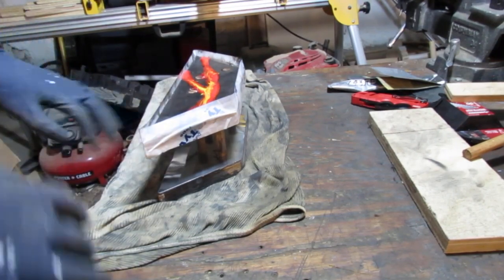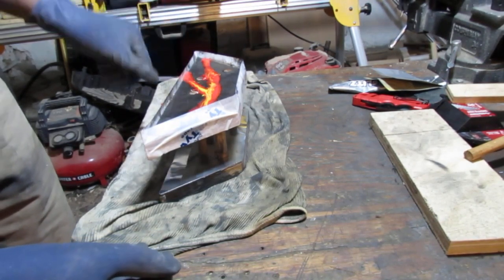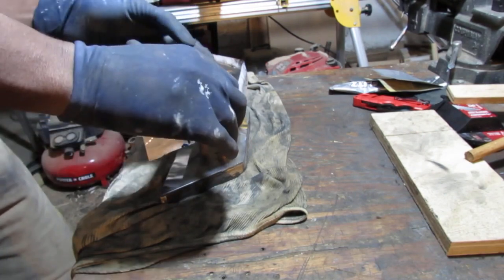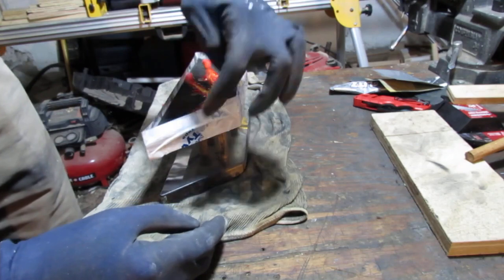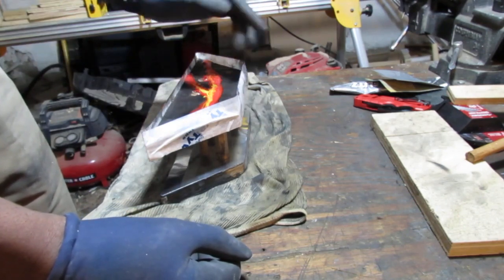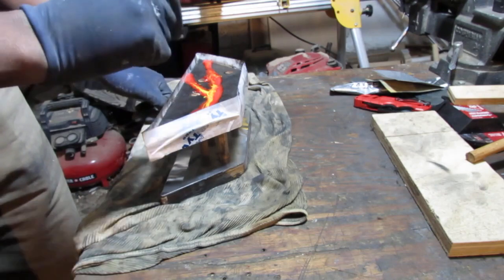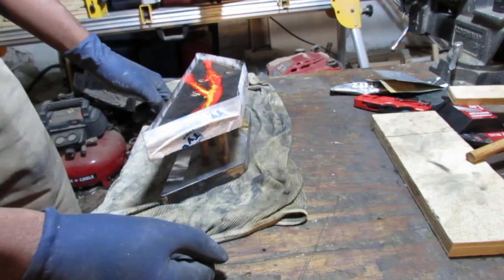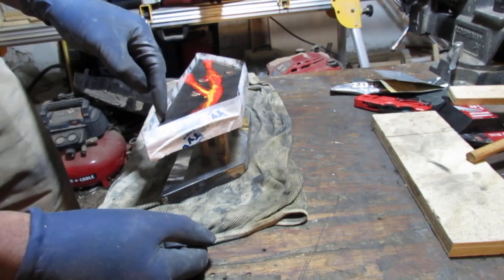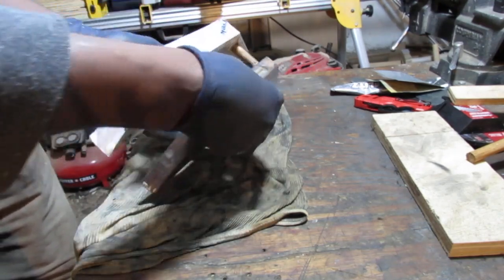I've got to make an executive decision here. It's going to affect a lot of stuff. I'm going to pour another layer of epoxy, right? But if I pour that layer of epoxy, if I leave this little catch-all area here, because I'm doing that to protect the wood on the side, I want the epoxy to get to that. I'm going to end up with potential little bubbles in here that I'm going to have to get rid of, right? Now usually you do that with a little bit of heat, but I don't have that privilege, because if I apply heat, it's probably going to melt the plastic, and then the plastic would get stuck inside the epoxy. So I'm going to move forward with it like that. But anyway, this is what we have so far.